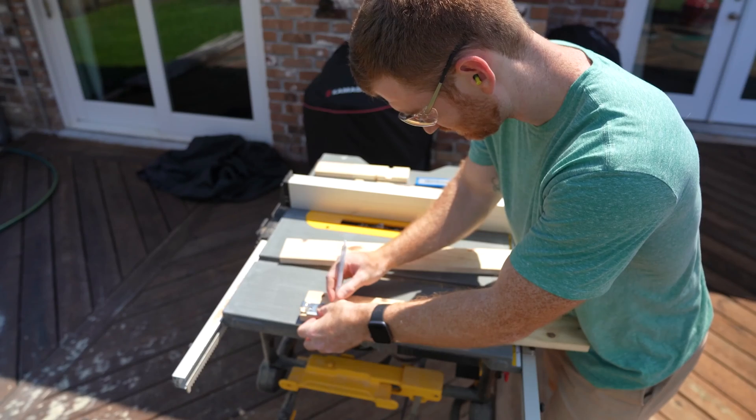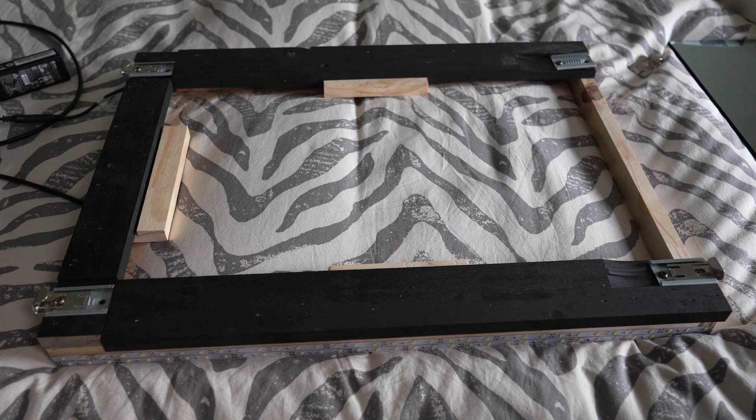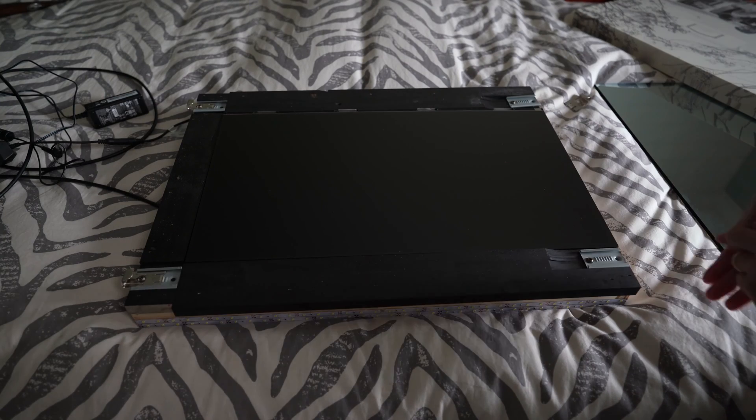To fit my clamps to hold the mirror on, I inlaid them into the wood so that everything was nice and flat and uniform. I don't think that's a required step — it's definitely a little more advanced on the woodworking side. If you're just going to be able to cut the wood and that's it, you don't necessarily need to do it. But if you're interested in inlaying them, instead of getting an actual dado stack for your table saw, you could just use the blade you have and make a bunch of one-eighth-inch cuts to slowly make that inlay so you can lay the clamp in there.